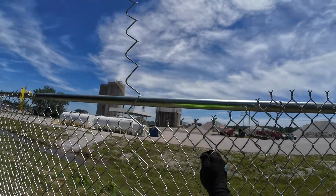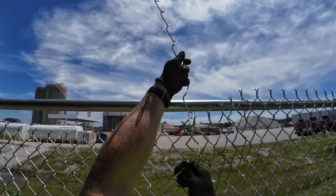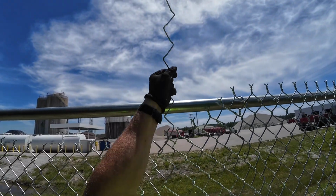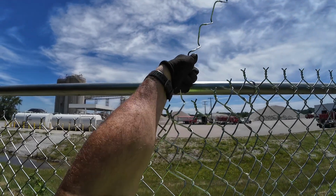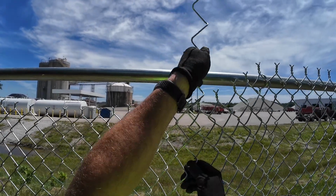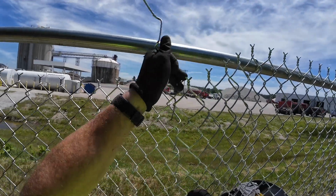There are some little tricks to this. I'll start it a little bit, and then I'll check it to make sure, because I've had it where I've wound it a diamond off. If you just focus on it and get to the bottom and look back up, you realize your diamonds are off, like one's higher than the other, your pointies at the top, and you've got to tear it back apart. So I normally like to go down maybe about a foot or so, pull the slack out of it, and look at it and go, okay, it's lined up. It's good enough to keep going.